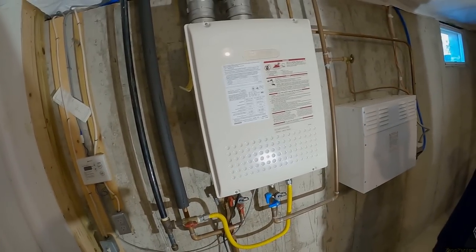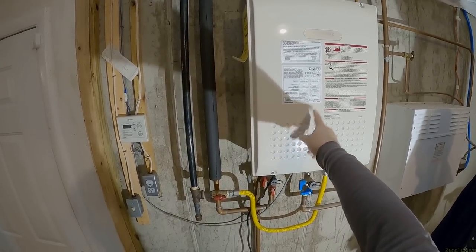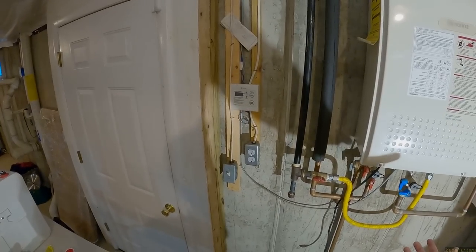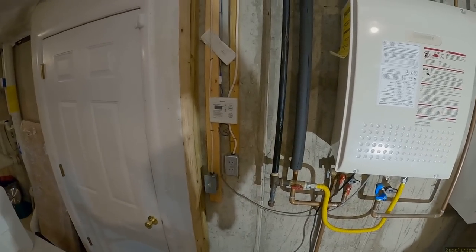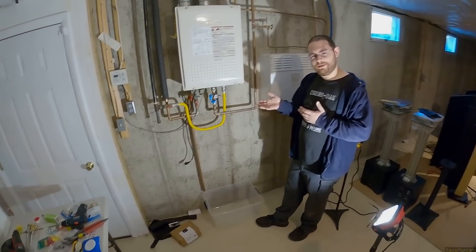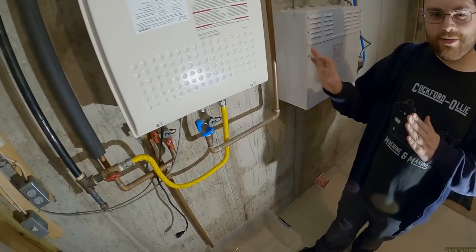When I go to take a three-and-a-half-hour shower, the draw will be enough that the instant heater kicks on and puts hot water into the tank — which is already at 130 degrees — so it'll just shut off. This will heat the hot water in the tank which I'm already drawing from. When everything's said and done, the instant heater shuts off and it goes back to just being an efficient little ball of insulation. It's like a hot water capacitor.